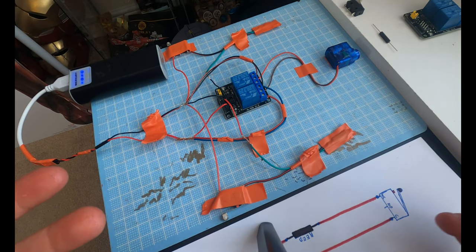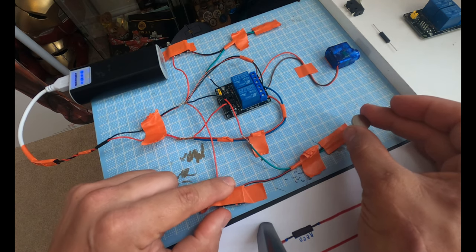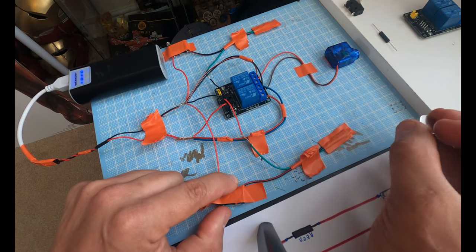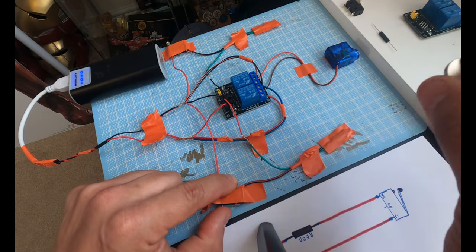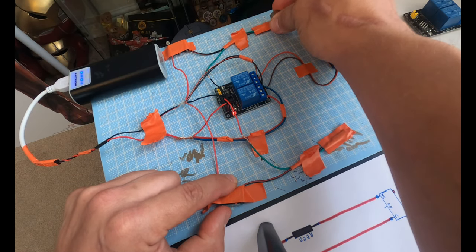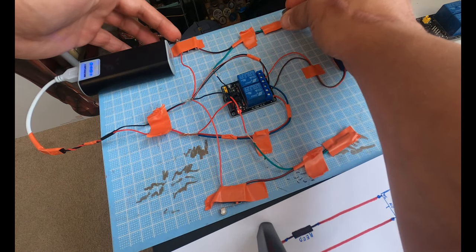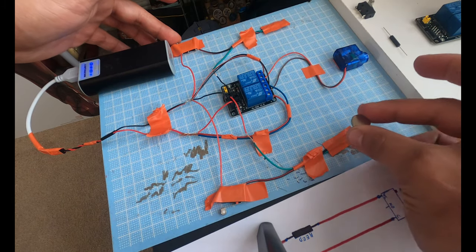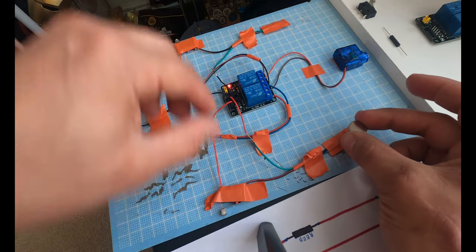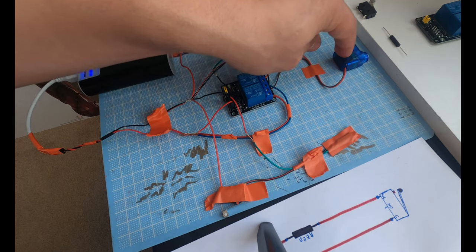So imagine if the mask was closed and I wanna open it. Open. When it hits this trigger, it stops. And this is what's gonna tell the servo to stop moving. We don't wanna burn the servo out, we don't wanna risk breaking our mask. So now the mask is open, I wanna close the mask, I go over to this side, and it still works, even though this trigger is being held. And then when the mask is fully closed, this other trigger over here gets touched. And you can go back, open, closed. Open, closed. This way it saves the servo from ever taking any damage.